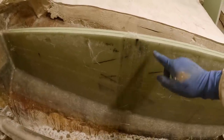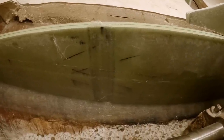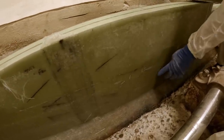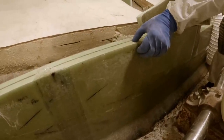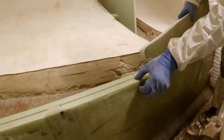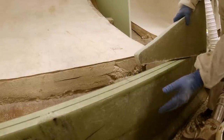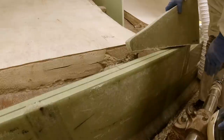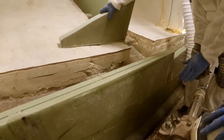So I also taped up our seams. This is where we connected the panels to. Yeah, so just use the same layers we did on the rest of it, and it turned out pretty good. Pretty flat. Little lump. So you can see with the tabbing coming up the hull now, that's built this panel up even more. This tabbing is basically the equivalent of this middle layer right here. It's two layers of 45, so we've added over an eighth of an inch to the thickness of this panel again, essentially on both sides, at least the lower portion of it.